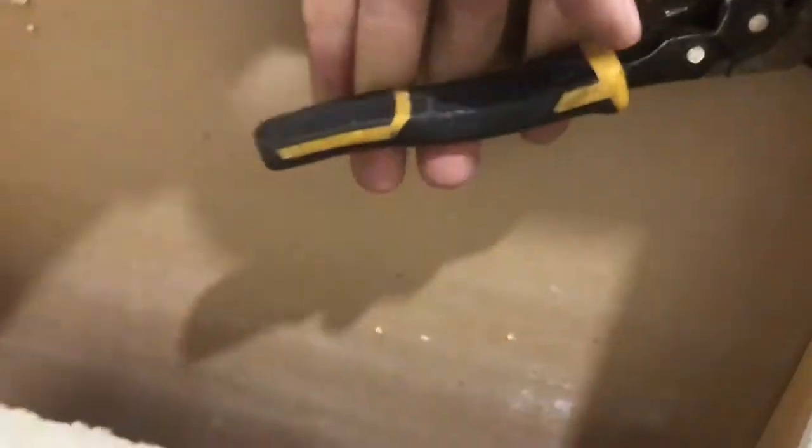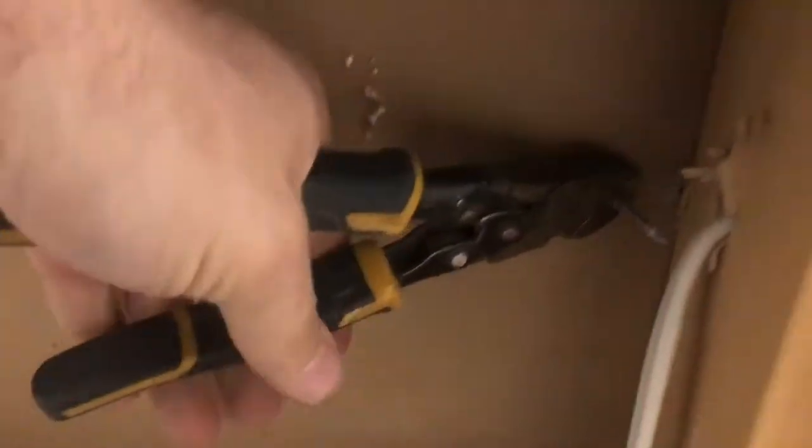And at that point, you see the internal components. And here, we're missing a whole pile of wood. You're supposed to have like a 2x8 going across there, usually thrown in by the framers, so that when the railing guy comes in, he can literally just bolt it or screw it to the wall.